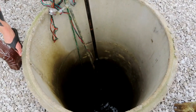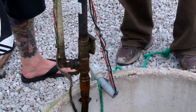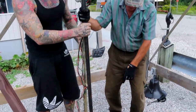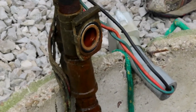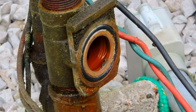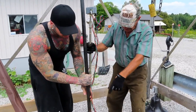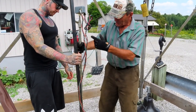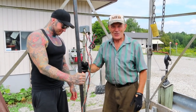Pull her up, Ryan — up she goes. Watch this cable wire. There's the inside of the pitless adapter with the O-ring that makes the seal. You see how that's triangular shaped? That slides down into the well part of the pitless adapter. Pull it up another foot or two — you see the clamps? There's the plastic pipe for the pump. Just that easy. I got to loosen those clamps, take the pipe off, disconnect these wires and the pump's out. That's how simple it is to pull your submersible pump out of your well.